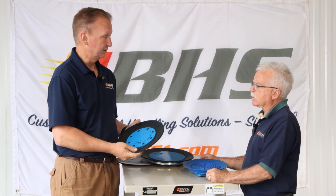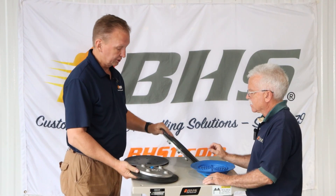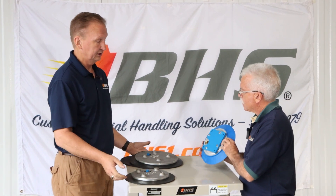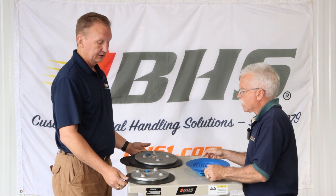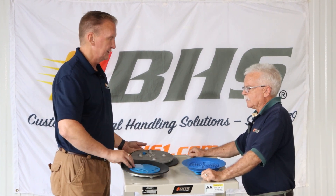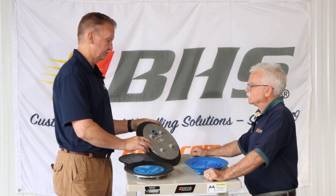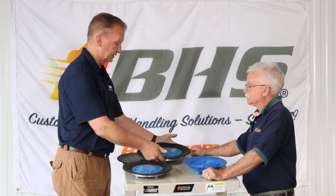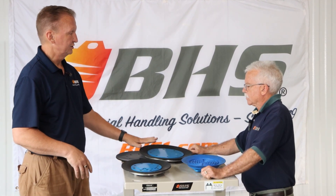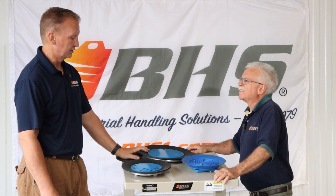About 20 minutes of unbolting and re-bolting and you've got a brand new cup. The mounting on all sizes of the cups is identical, so any cup could be used on any extractor unit. If you've got narrow batteries, you're going to have to use the 10-inch cup. If you change batteries and go to a bigger battery, you can get a bigger cup. The pulling power is slightly better on the 12-inch cup, so for larger batteries you need the larger cup.